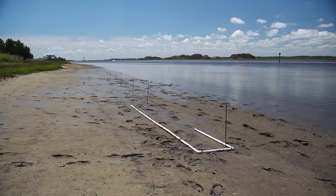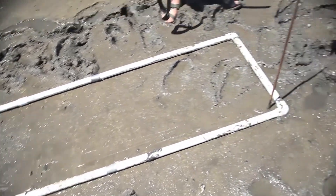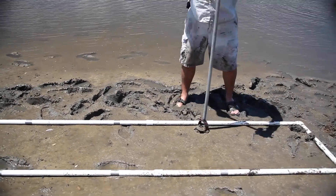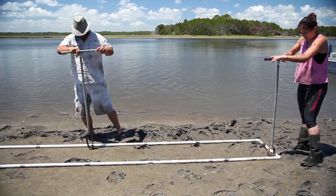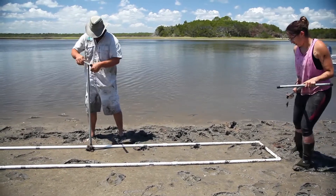Then using a mold or some sort of marker you will use the ends of the wall to position the fence posts. Using your PVC grid you now have where you want to position the fence posts for your wall. What we do in our group is first use the soil auger to mark the position of each one of the posts — you'll just auger down basically one auger depth into the soil just to mark the position. Once you've marked all 14 of the fence post positions you can remove your PVC frame and then come back to actually dig them out.